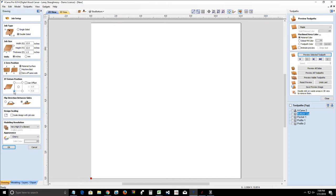Now, for those of you that have changed over to TNG, there's a little bit different process when touching off with the quick set. We also have the ability to create our own little G code for our DWC quick set and use that G code when we're touching off. I will show you how to do that in a short video, and you'll also get the spreadsheet that will help you generate that very simple G code. I will have that complete this week and post it out.